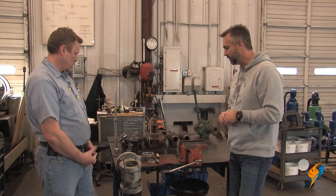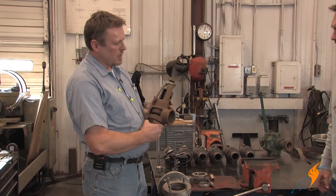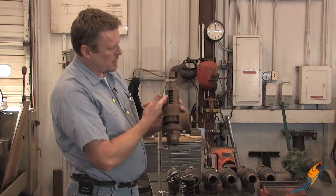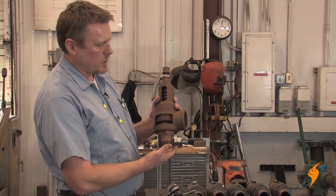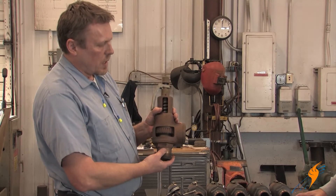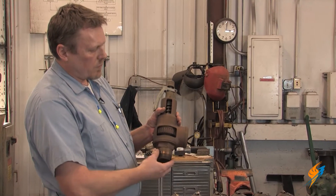So maybe tell us a little bit about how a relief valve works. This particular kind of valve is a spring-loaded relief valve — it's what you're going to find typically on a boiler or an air receiver. It works on force: basically spring force keeps the valve closed. When the valve is in service, you have pressure that comes up inside what is called the nozzle. And when that pressure equals the spring force, this valve will open up.